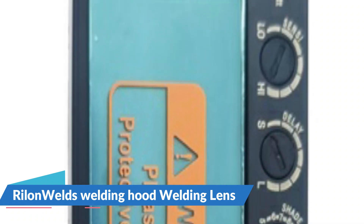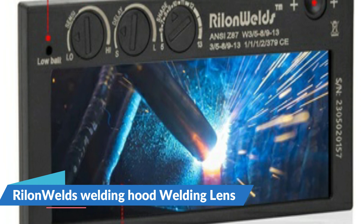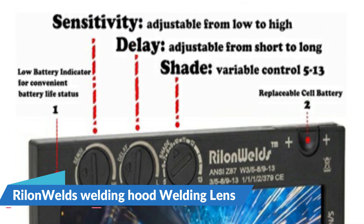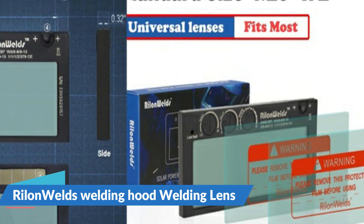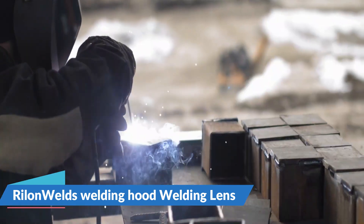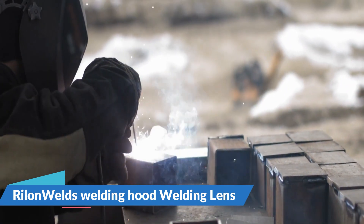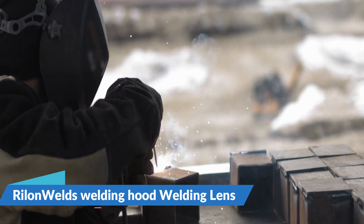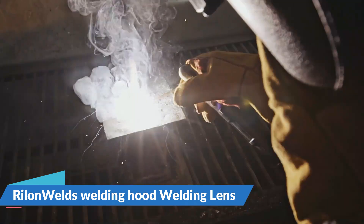The lens has no orange or green tones and automatically dims when exposed to infrared and UV wavelengths. Low to high sensitivity is stepless adjustable for optimal lens performance based on application. The welding lens has a variable shade range of 5 to 13 for personalized shade control. Lens covers protect the front of the lens and are replaced whenever clarity is impaired. You get two cover lenses as spare parts. Battery life is about 800 hours; store the lens in a dry, dark environment when not in use and keep CR1025 spare batteries on hand.